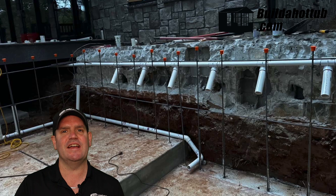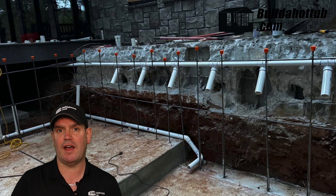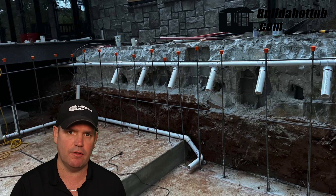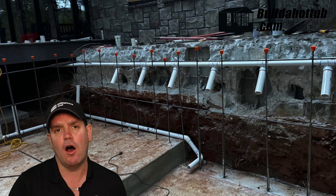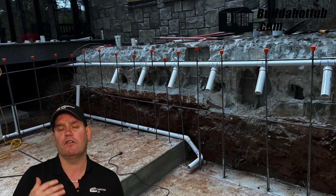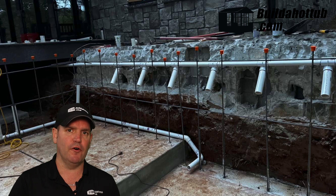With the base finished, the next stage is to put the plumbing into the rebar before you form up the walls. Jeff wanted a few jets in his plunge pool, so he's adding in the bodies that have two-inch water inlets on the base and one and a half inch on the top for the air. They mix together and you get really nice bubbly jets. He's only got them on one side of his tub, but they need to go in before you can put in the forms.